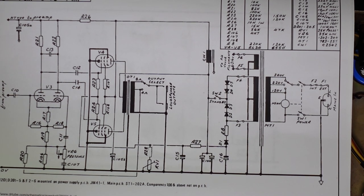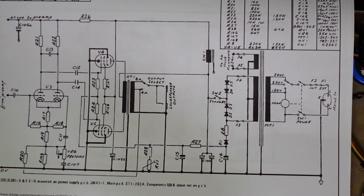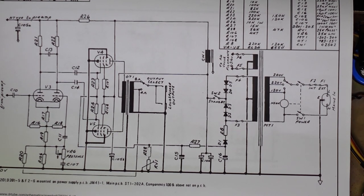So if you have an amplifier with a standby switch, power on first, then some time after, it doesn't have to be long, give your filaments enough time to heat up. These will have already charged up, and your bias will already be waiting at its negative voltage. Then you can flick your standby into play mode. If you have a tube rectifier, that's going to slow down the whole process anyway, in which case you probably don't even need a standby switch at all.